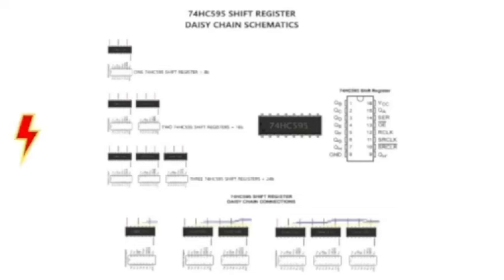This layout is tiny on my OBS screen, so you won't make out the writing — but just look at the little shift register chips and their pins. This shows my single shift register chip layout. You don't need an output on a single register. With two you can daisy chain, with three you can daisy chain as well. Down here I show the schematics. In the two-register example I have one yellow rod over a blue by mistake — that was an earlier layout I didn't catch until after.